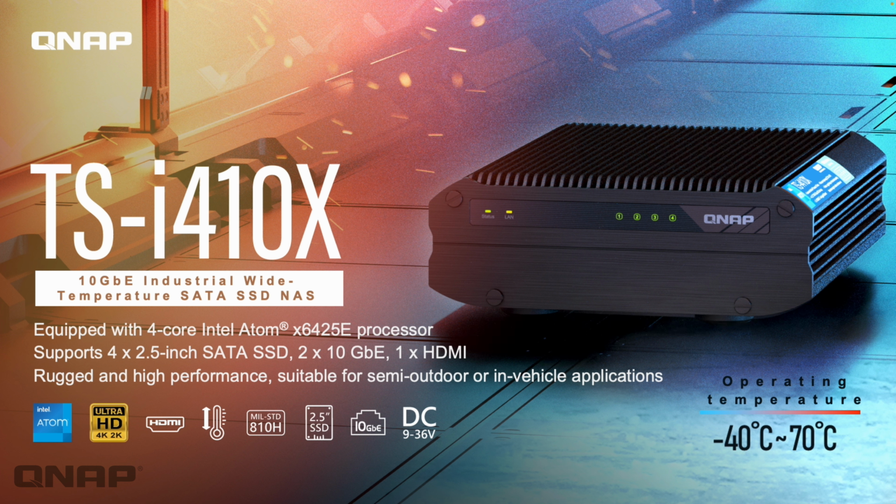At the heart of this product is an Intel Atom X6425E, which supports quite high temperatures on its own, and it supports 4 2.5-inch SATA SSDs. There's two 10 gig ports, even an HDMI output as well. Very rugged, and it withstands a wide operating temperature window, minus 40 Celsius up to 70 Celsius. And it's also really good for any environments where there would be vibration, like in a vehicle, for example, in an industrial setting. So we'll move straight on to some detail about the NAS.